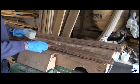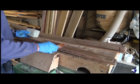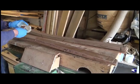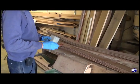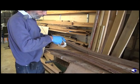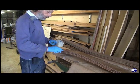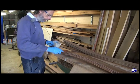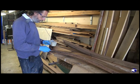The epoxy does generate heat when it's reacting with itself. So if you mix up a huge pot and then take your time distributing it, it can start to get a bit thick and start setting. So it's better to mix up several smaller amounts. And the flatter the container, the better, really.